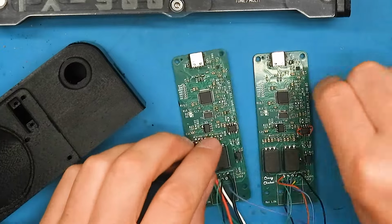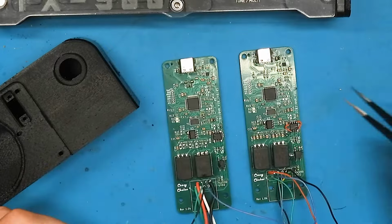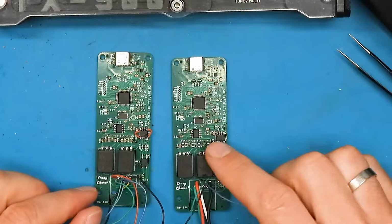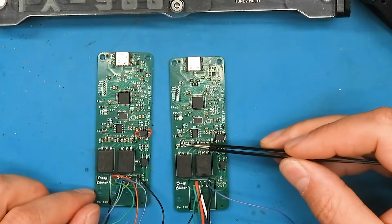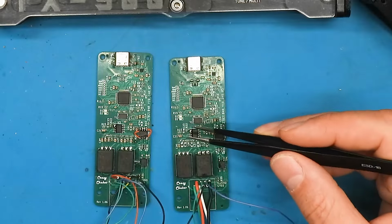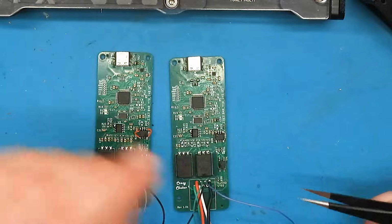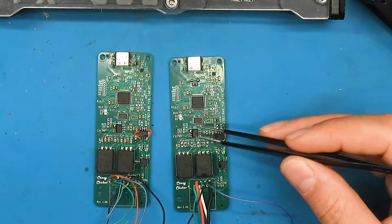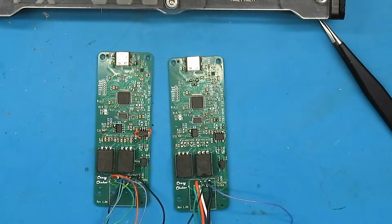I looked at the schematic and I will adapt my original here, what I had in my TX-500. I will adapt the circuit how I have it here, because I have some passive filters here, low cut, high cut, that are unnecessary. I tested it, and I did not remove these on this circuit. So I will make everything how I have it here. But for this I need the microscope.